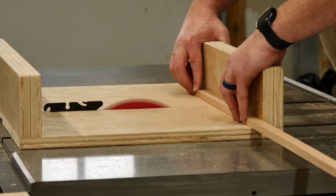To apply the polyurethane, I once again use my normal method. The first coat is a one-to-one mixture of poly and mineral spirits. The second coat is a three-to-one mixture. And then the final coat is just full strength polyurethane. I once again allowed ample dry time between coats. Then I sanded it lightly with some super fine steel wool and wiped away all the dust using some tack cloth before moving on to the next coat. And once that was done, so were the shelves.